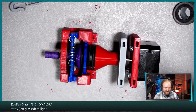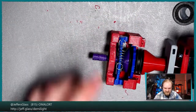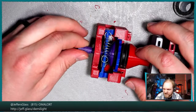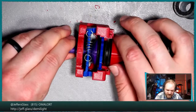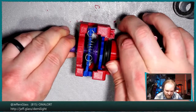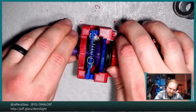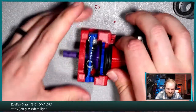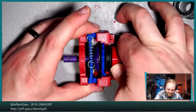It's wild to see it start coming together after all these weeks. Yeah, that's pretty cool. So the principle here is the same as it has always been. When the friction frustum spins clockwise, it tightens its grip on this friction washer. And when that friction becomes sufficient, it will start to rotate the ratchet wheel. And when it does that, it will cause the arbor on the other side to spin, lifting a load that is attached to it. I'm just rotating this by hand for now.